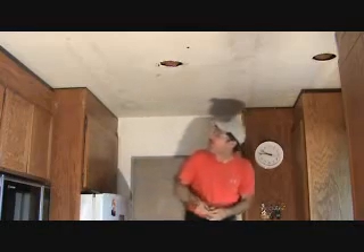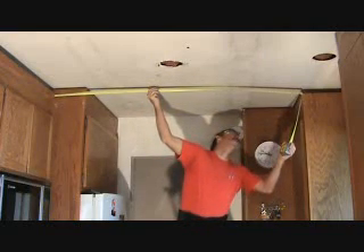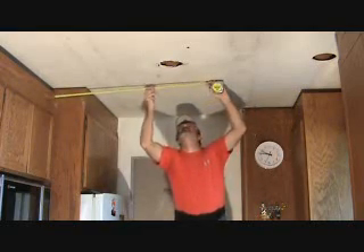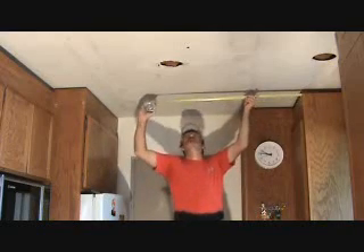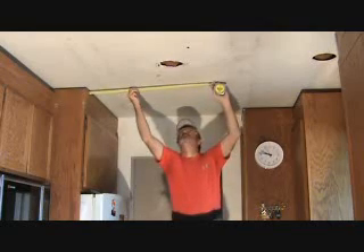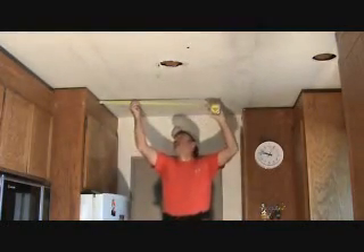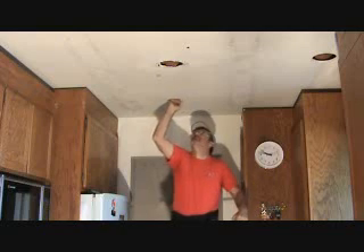It looks like 34. Let me double check this again — I'm almost slightly out of skew, not much. I'd go 68 and a half, that'd be 34 and a quarter. 34 and a quarter — we'll move this back a little bit, and I can kind of scratch off that line. From there over it's going to be 34 and a quarter. So now there's going to be a light here and one back here. I want this line to be back further, so now I can measure off of there — 25 and a half — and come back this way. I'm just going to put a C over the line, meaning center line.